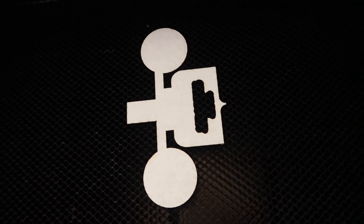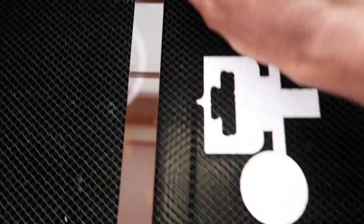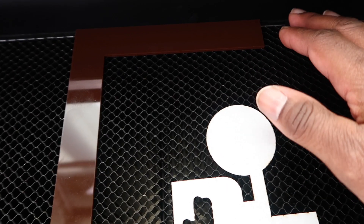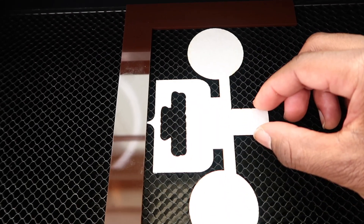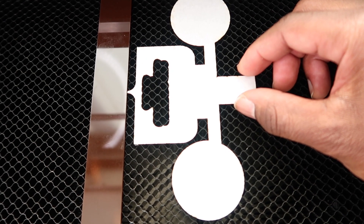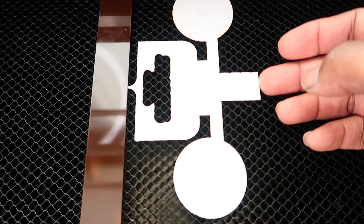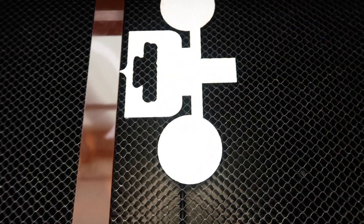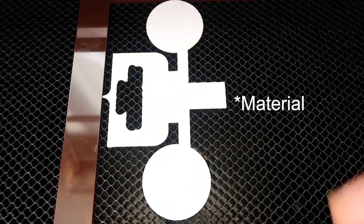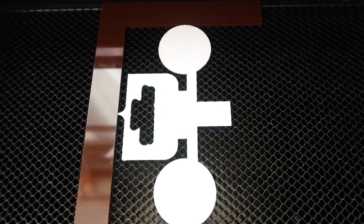But say you've been using that piece of acrylic and you have some little bitty pieces left over that you want to use — a shape something like this. The 90-degree tool comes in handy. What I would do is line up the edge right at the top of the cutting bed, make sure it's all flush, then take my odd piece and put it right up against it, bump it all the way over. Make sure it's real close there and up there, and you'll have a nice right-angle 90-degree piece so you know your design is straight when you cut or engrave on it.